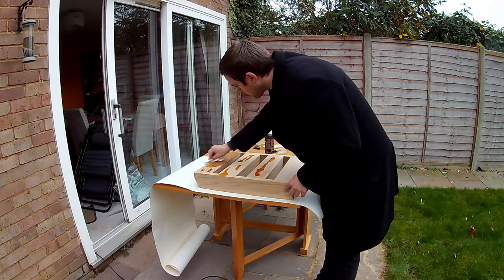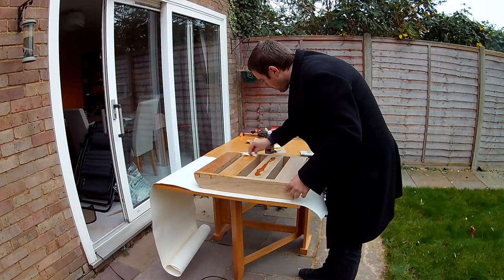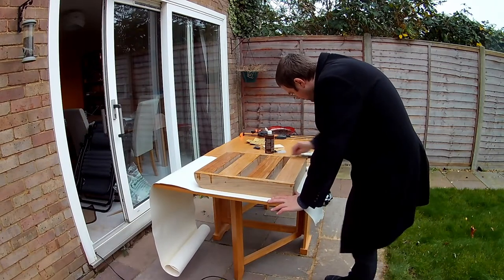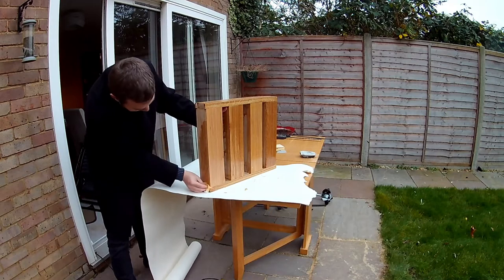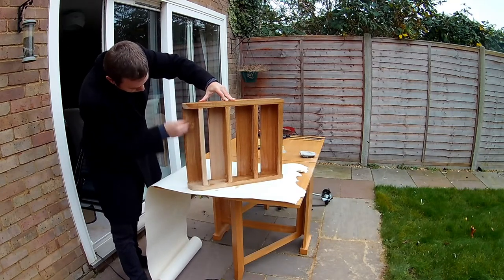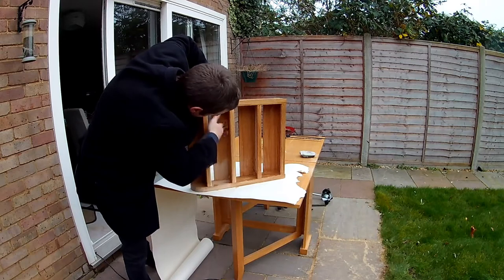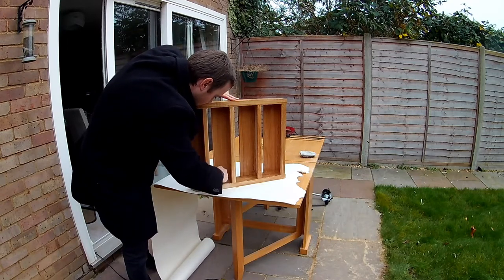This worked well and it was very satisfying seeing the wood change colour, however I realised quickly that the tissue paper was the wrong tool for the job — it basically worked, but it just fell apart as I used it. I carried on rubbing the oil in; the amount I'd splashed on the back was pretty much enough to cover the entire thing with a decent coat. I went over it a couple of times to make sure I hadn't missed any bits, and then left it standing to soak in. After an hour or so, I came back to give it a rub down to remove any leftover oil on the surface. After a few days, once I was convinced it had dried reasonably well, I came back to give it another coat of oil, partly to make sure I hadn't missed any spots, but also just to deepen the finish a little bit. This time I actually used a cloth so it wouldn't disintegrate. I then left it for an hour or two and buffed the oil off again. I'd finished the build in time to leave it standing for about a week to make sure the oil was properly soaked in and dried before wrapping.